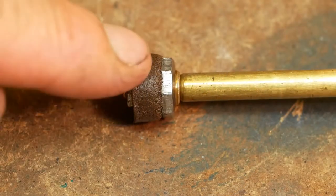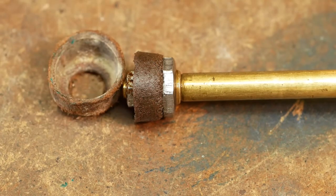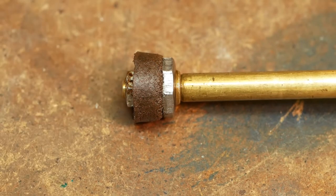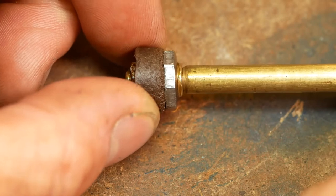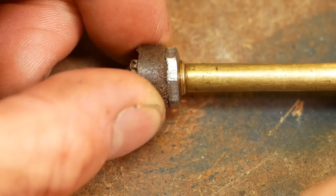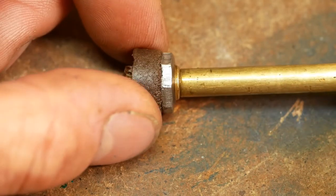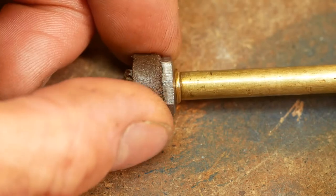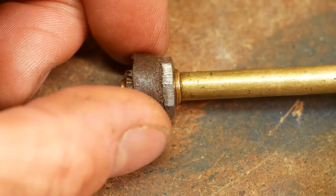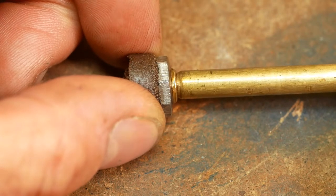Additionally, the pump washer was worn out and needed to be replaced. Rather handily, there were some spares of those in the little metal box. At the same time I noticed that at some time in the past someone had fitted a washer to eliminate the slop of the pump washer housing. But that slop is actually meant to be there — when you press the plunger in it seals against the taper on the shaft, and when you pull the plunger back out the body should move away to allow air to pass through so you can withdraw the plunger.